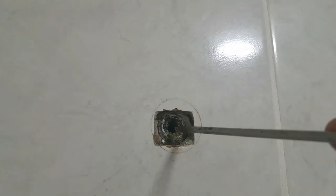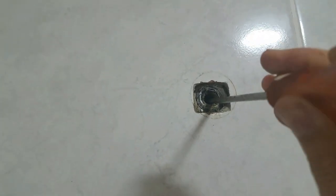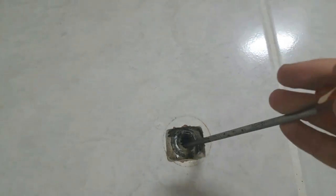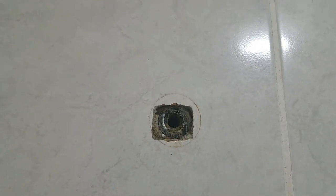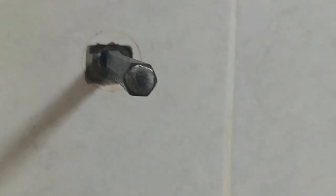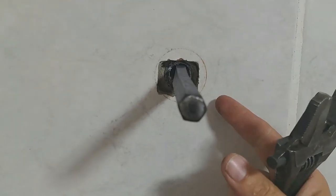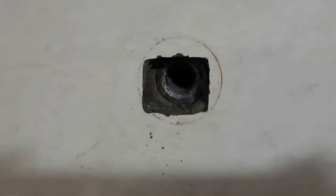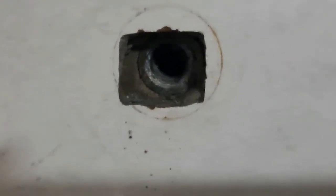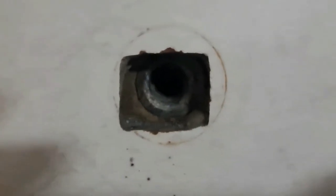So let's do that. I'm just going to take this screwdriver and see if I can get some of this nonsense out as far as it will allow me to go. I can't record and do it at the same time so let me just pause the recording. Luckily I've got this thin chisel - I've put it in there. I'm going to take my multi-spanner, or shifting spanner as we call it here, and try and loosen that piece of the pipe that's stuck in there. I did put some degreaser in there just to see the threads better and to clean the threads out.